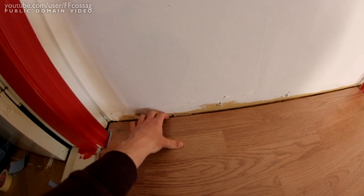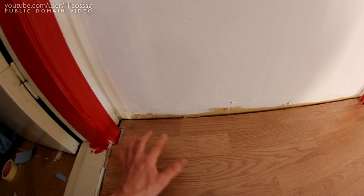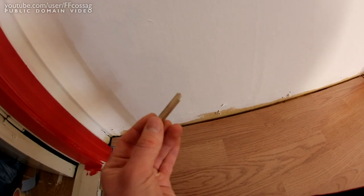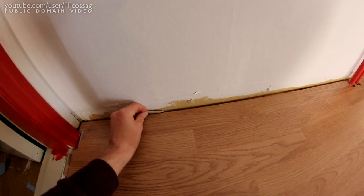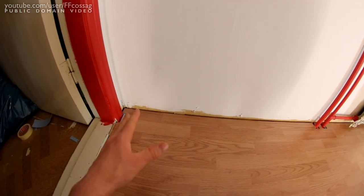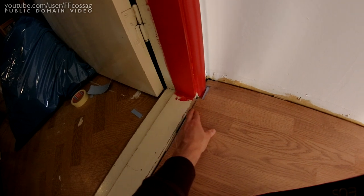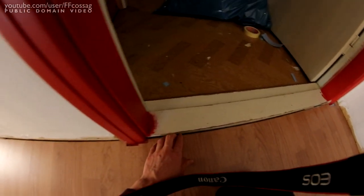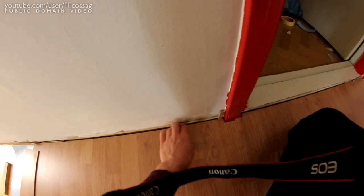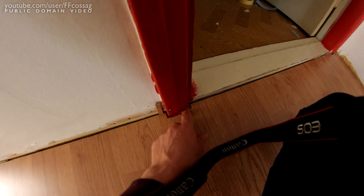Setting this floor down, you're supposed to leave about 10mm between the walls and the edge of the floor because old houses move around. I've opted to use some pieces of the floor, so we're 6mm from the wall on all sides. There's so much slop in these horrible cardboard walls — it's not a big deal. I'm keeping pretty decent tolerances, not letting it get too ridiculous. It's hard to get this to look good, but I think I've done a decent job.